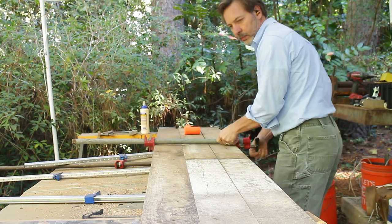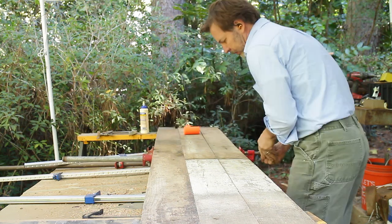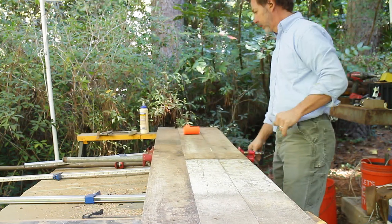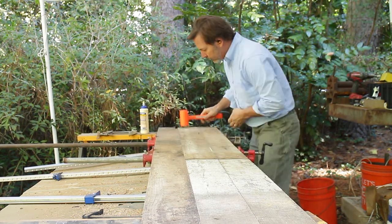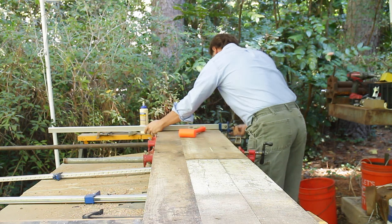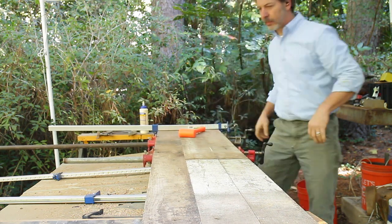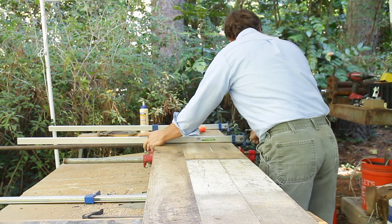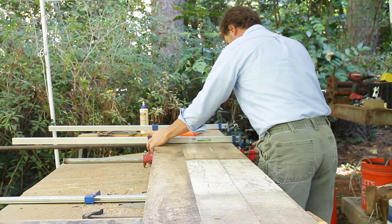Right now I'm working on the bottom shelf. This is only three boards, so there's only two glue surfaces to combine. So I clamped them together and made one board at one time. The top surface took four boards. I actually did that in three steps, out of my experience that whenever I try to get too many boards glued together at one time, I get shifting and I get problems and I have to work faster. And I failed at it several times.